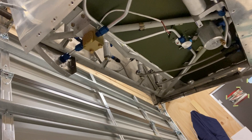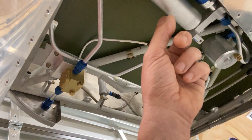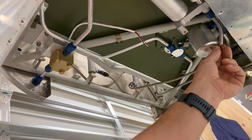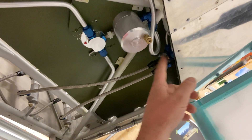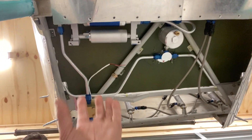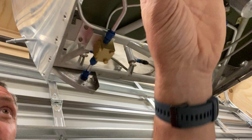With the fuel system, the fuel flow transducer mount is all finished now and I'm very happy with how it came out, though it did take quite a lot of work — I went through at least three different iterations before I found one that worked. You can also see up in here the fuel pump, the gascolator, the fuel quick drain — there's an opening in the tunnel cowling for it — and the bottom of the fuel selector. Over here is the park brake valve, and I'm very happy with that location. Everything under here is mounted within one bay. The tunnel comes back to here and I've got inspection ports on the side, but in reality the whole lot can be taken off in about two or three minutes, giving me full access for maintenance.